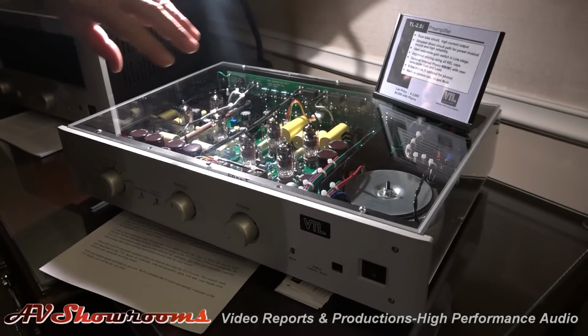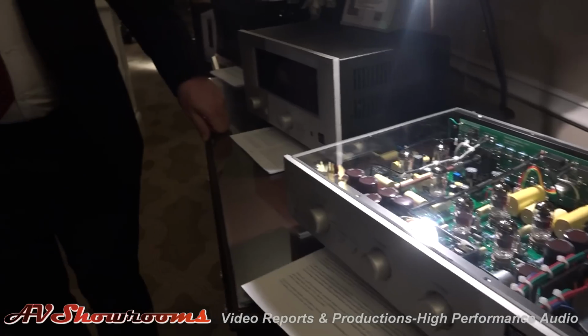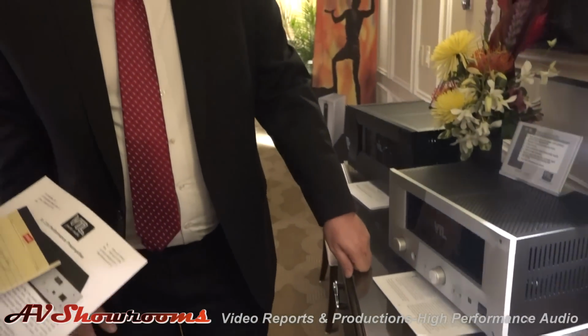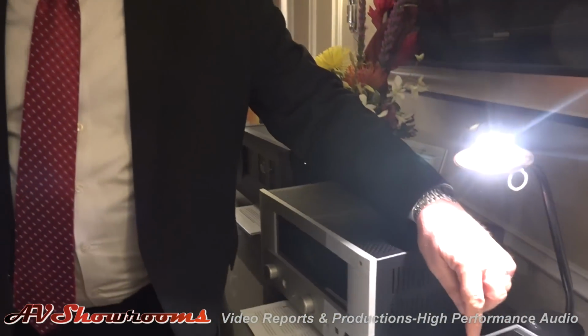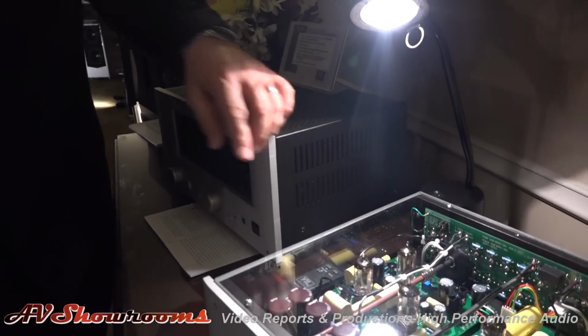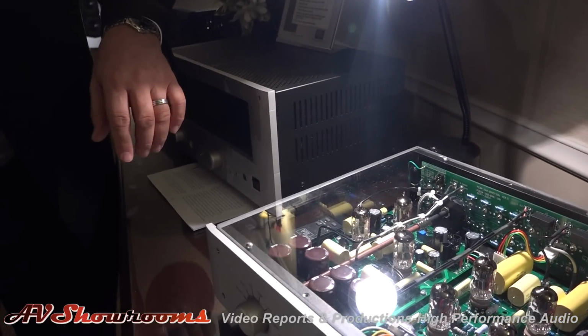We revoiced the circuit and lowered the feedback, and it sounds quite a bit dramatically better, strangely enough, with these gain switches. And then for the phono stage, we added trickle-down technology from our TP 6.5 and TP 2.5: the loading, the JFET tube MC stage, and the ability to load cartridges and set gain for MC. It also has an MM input, which is set by means of these jumpers.